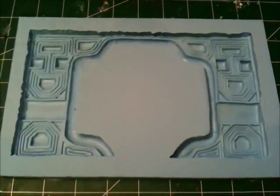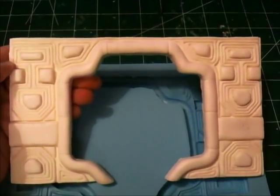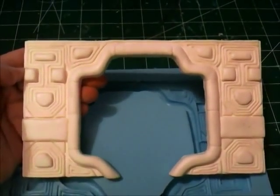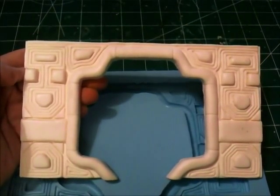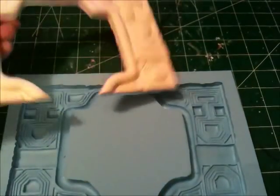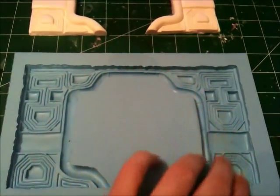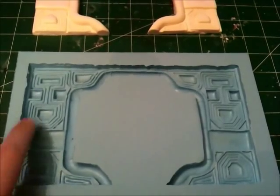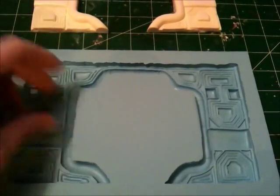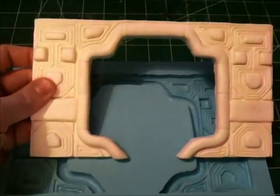Let me show you the plastic casting that came out of it — this is really cool because it came out perfect. If you look at this, there's no air bubbles at all. It's hard to tell in this video but it came out really nice and I was very happy with it. I had full control over where the air bubbles were located. Since the casting material is clear, you can see throughout the entire thing while it's before it cures where any air bubbles might be hiding, and you can just take a little wire or a toothpick and go in there and knock them out. When it cures, you don't have to worry about it.